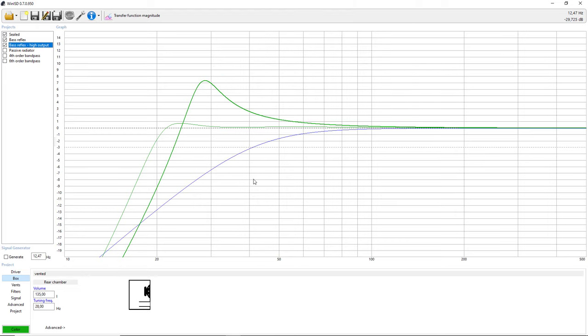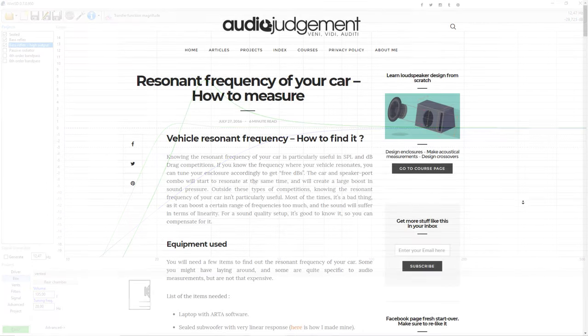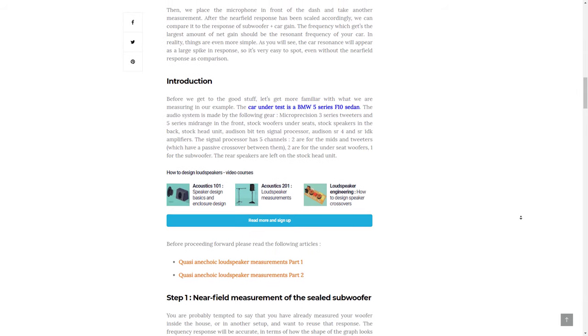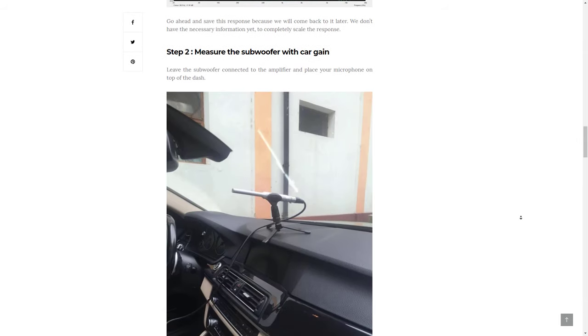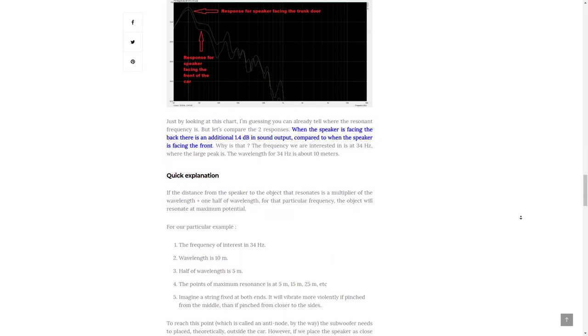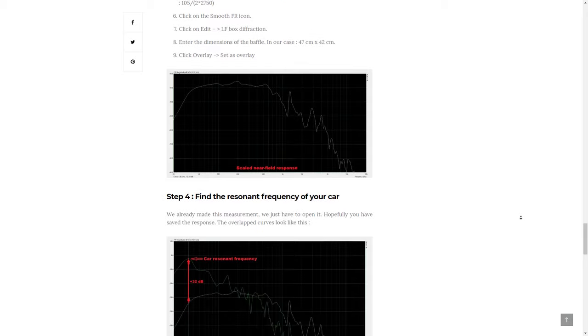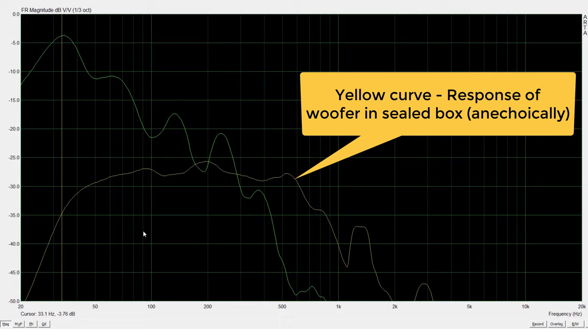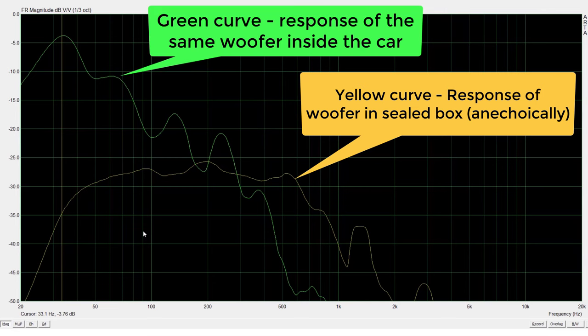Why I chose this frequency is because previously I calculated the cabin gain of my car, so I will link in the description the article where I measured a sealed subwoofer anechoically. You can see that one curve is the response of that subwoofer anechoically, and the other curve is the response of the same woofer in the car, so it has the car response as well.